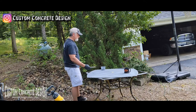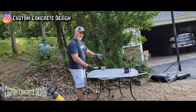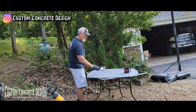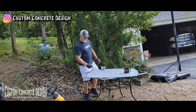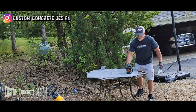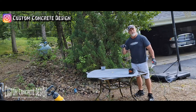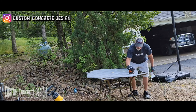So now, I know there's going to be a bunch of concrete boogers and stuff like that. I can go ahead and smooth that out once I have my lines down. But the main thing is that this is sealed up so that white doesn't penetrate and bleed up underneath that tape. So this is our tack coat.